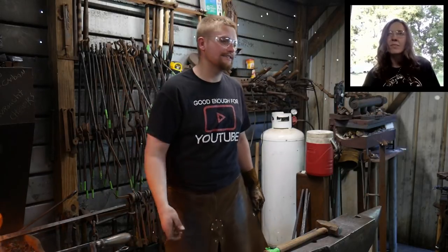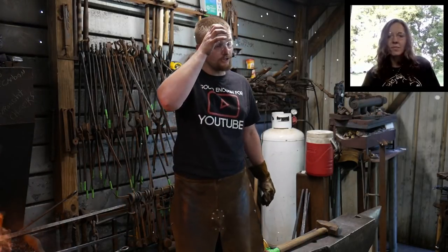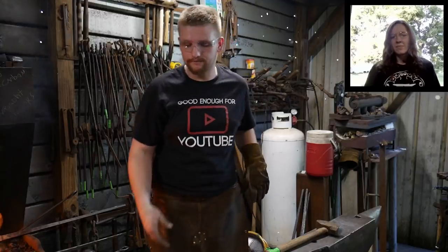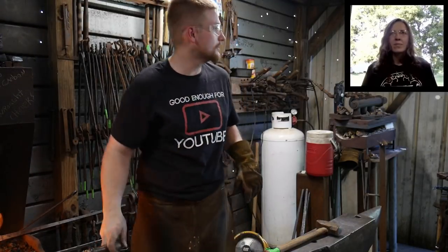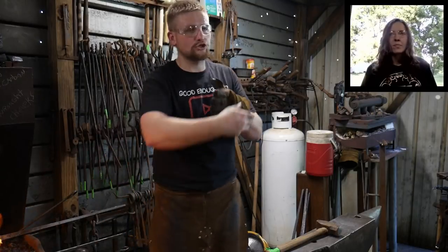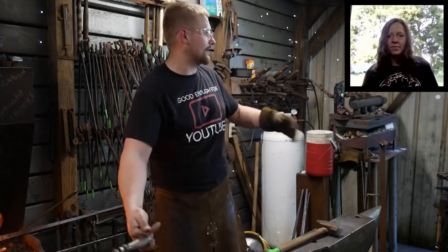Now that's not necessarily saying that that's exactly how much material you would need to make it around that piece, because you have to take into effect that you're going to be bending it. And whenever you bend something, it sucks up material, because you've got to bend away from the other jaw, then come around. So technically, you're not just coming around a piece like this, hooking around. So that extra bend, you've got to add a little extra material in for that. When in doubt, add a little extra on and then cut it off if you don't need it.